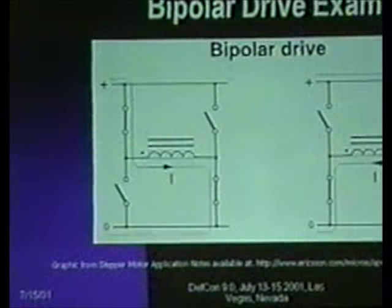If you turn on both sets of switches on any H-bridge, you suddenly have a very low impedance path from VCC to ground, and the thing will emit light, smoke, or fire, depending on how much power you're putting into it.